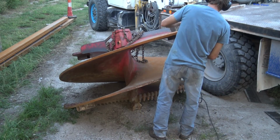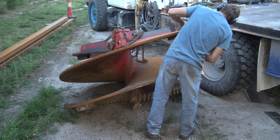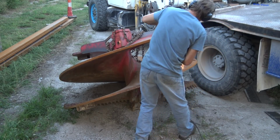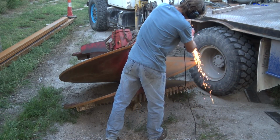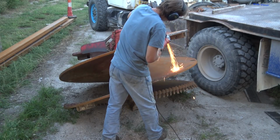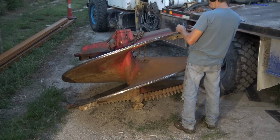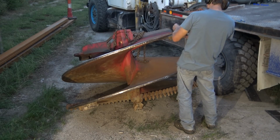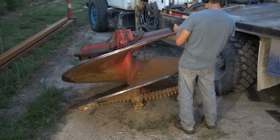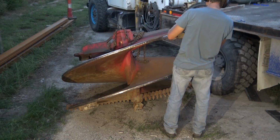They went and ground off all the old hard facing, which is awesome. Saves me a lot of time. But unfortunately, we've had a lot of moisture lately and it is all rusted up again. So I'm just going to take it to the flat disc on the angle grinder and shine it up. I'm going to draw a little bit, figure out my pattern. I have to at least have some reference points on there, otherwise I'll start making my zigzag longer or shorter.